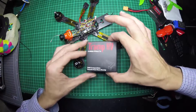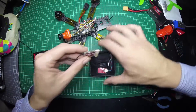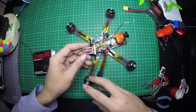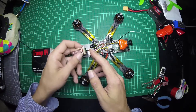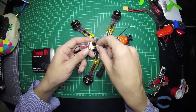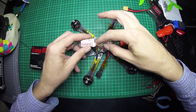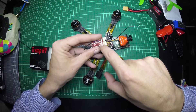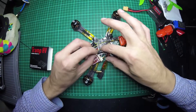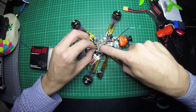G'day guys. I recently added a Tramp HV telemetry to my quad for some testing for Betaflight and I wanted to show you guys how easy it is to add this. It's well explained in the wiki but I just wanted to add a video. Basically we plug our harness in — in the box you would have got one of these harnesses with a little white wire and another wire for audio. The white wire goes to a T here, and that's a T for telemetry. This wire will go to any free transmit pin on a free UART on your flight controller.